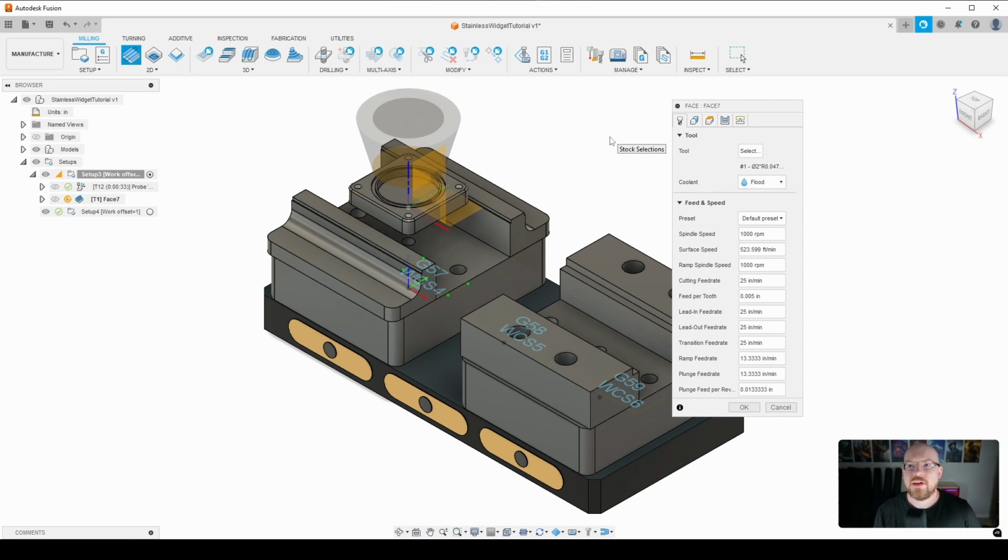Now, so far, I am not happy with the surface finish I'm getting from the high feed shell mill. You can see here, let me see if I can get it to where it zooms in or where we focus. Now, to be fair, the finish is silky smooth to the touch, whereas the finish with the 5 flute is more coarse. It's not as smooth as with the high feed shell mill.